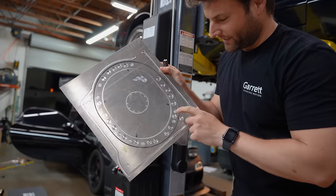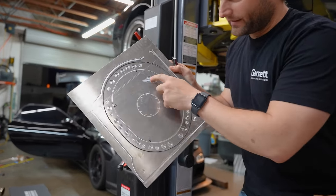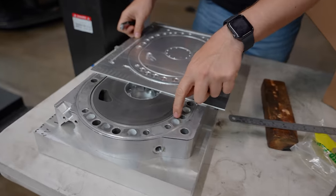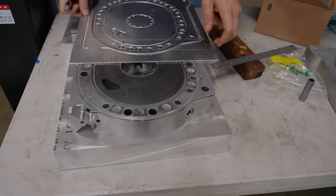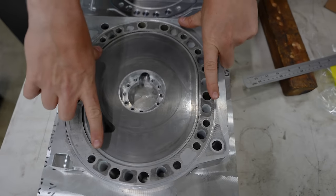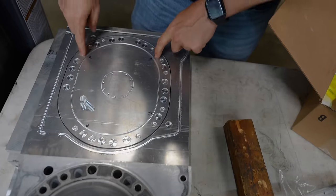This was our first version of the cut, and it's actually worked so well that this coolant seal has stayed in here the entire time. But the port on this side, we look at it right here, and you see the coolant is stained on the spots, so we know that that is a coolant spot, that's a coolant spot, and so on. And so I found the most squared off, hold-it-up-evenly type of spots, even though these are not even at all, but at least that gives us the ones that we do.